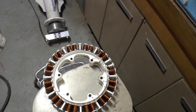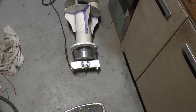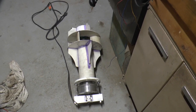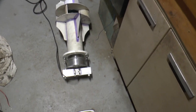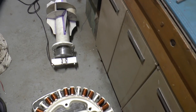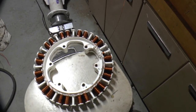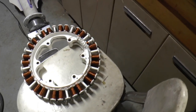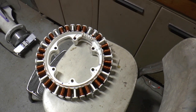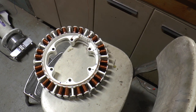Well, some of you that watch my channel regularly know I rewound the hoverboard motor in an attempt to get this turbine type thing working, and it did improve it. So I thought I'd try the same with the water wheel, which uses a smart drive. So I picked one of the aluminum ones because they're not as good. Pulled all the windings off it. There's 36 of them. Each one had 94 turns.